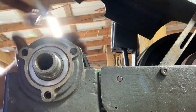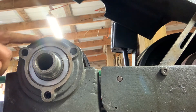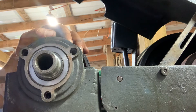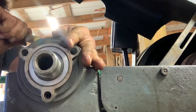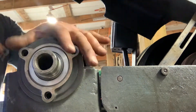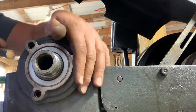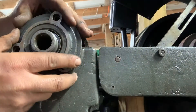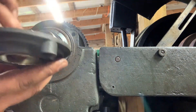Next you want to try to get this face plate off. You're probably going to need a little brass mallet. You don't want to pry too hard or hit too hard because this was most likely cast, which would snap, and then you've got to repair that. We found a piece of brass rod to assist us in getting that apart. Now we got that popped off — the face comes apart like this. We're going to want to put everything back the way we got it, so we're going to lay it all together.